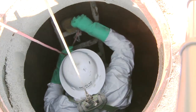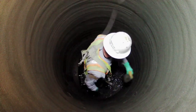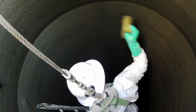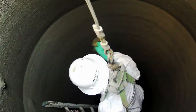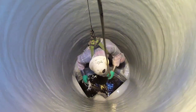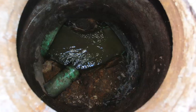After knocking down the mortar profile, sponge finishing is used to produce a smooth, lightly textured surface. Mortar may also be finished using a broom or brush depending on the surface texture desired. If the mortar is to be top coated with a corrosion barrier coating such as Mainstay DS 5, it should be finished to a smooth, somewhat grainy texture using a trowel and a sponge.